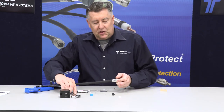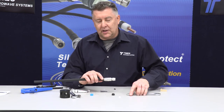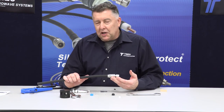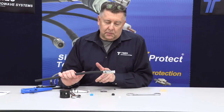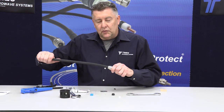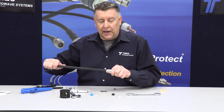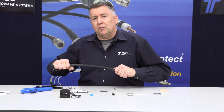I would say you want to make that nice and snug — roughly 60 to 70 inch-pounds. What you'll have is a connector that's very rugged; you're not going to pull that off. You have little teeth that bite into the jacket. The mechanical transition is actually separated from the electrical transition by about three quarters of an inch. So if you're side-loading this cable, you're not transmitting all that force to the electrical transition — you're capturing a lot of that in the back end. Therefore you get very good dynamic PIM performance as well as static PIM performance.